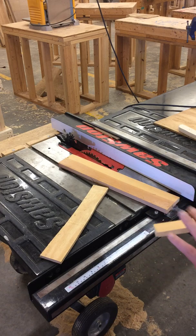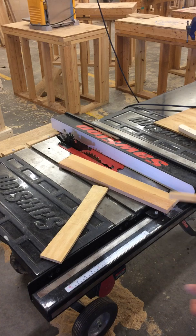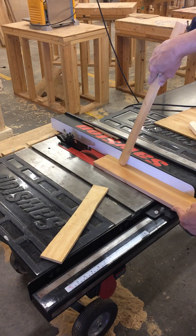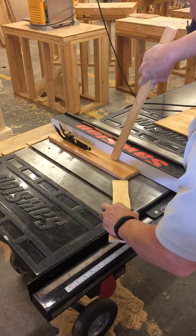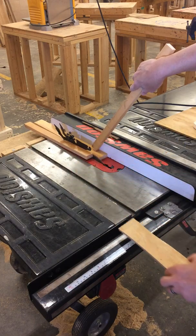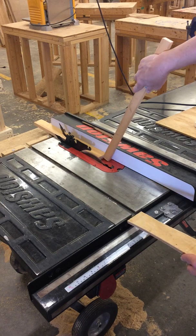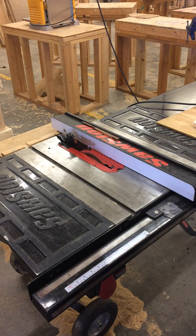So I'm going to turn it on, make a complete cut with push sticks, and push it all the way through. Then I'm going to turn it off. At this point, make sure you push your wood all the way through past the blade. Now I can move it off — I can either touch it with my hand or bump it with my leg. I'm done.